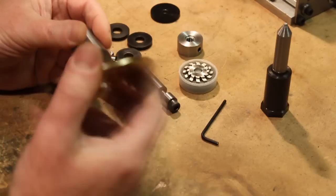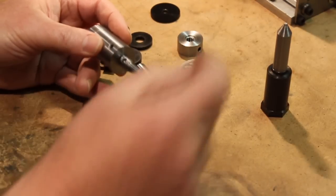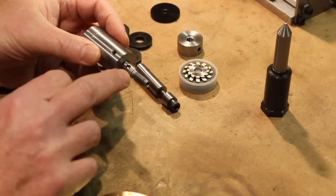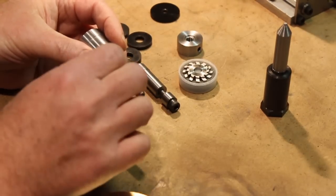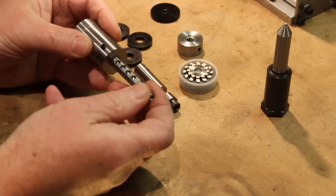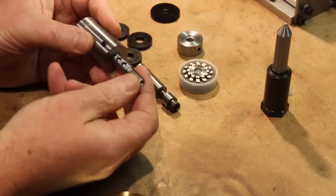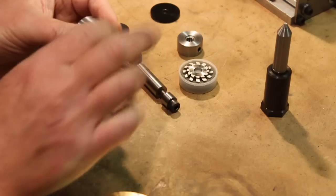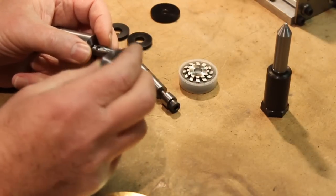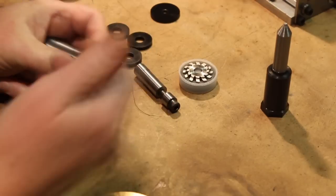This particular one was made for a three-eighths inch hub, and since I used it quite a bit I got a little fancy. The shaft has these dimples in it and there's a set screw so that I can stack as many gears as I want and then set the correct adjustment for the number of gears. And then I made a threaded hub here that will hold the gears in place.